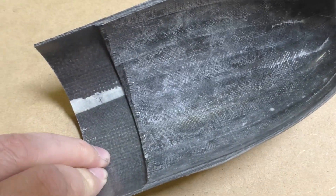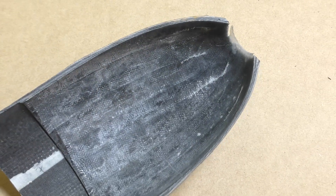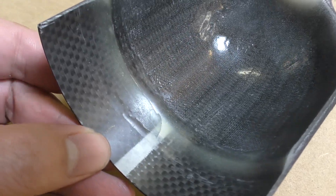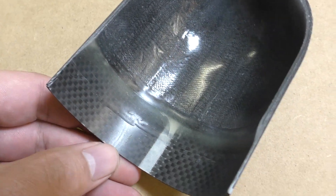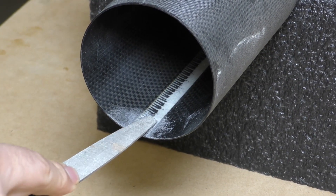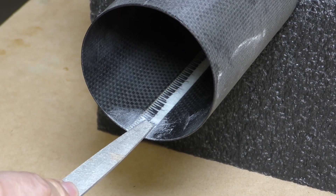In the previous test, we saw that the inner part of the tube along the length of the tape was slightly swollen, meaning that pressurised water found its way into the tape. This tape is under one layer of fibreglass and two coats of epoxy, but it probably only takes one tiny pinhole for pressure to leak into that space. We considered this as one of the potential failure modes, and so for this new pressure chamber we actually scraped away the tape from the last 15mm of the tube so that air couldn't make its way out. Upon really close inspection, we can see there may have been a small crack in the epoxy, and again it leads directly to the tape.